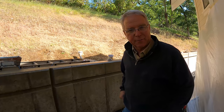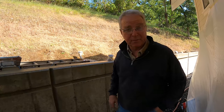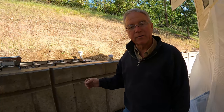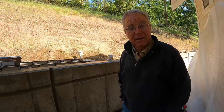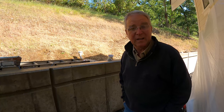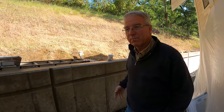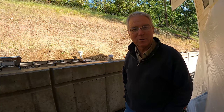That wall looked so much better down on the end after I had patched it that I realized I've got to do the same thing for the last 80 feet along the back here. It's on the north side of the building — it's in the shade all winter — and sure enough, there's moss that is going to start, and it's going to be an ongoing problem for somebody. So I've got a pressure washer and I'm going to try to clean this wall off down to where it's clean. Then I'll take the grinder, knock down the little ridges and the little horn bumps, and then go ahead and just sack up this whole thing. It's going to take me a while, but it's a nice day — what better thing to do?